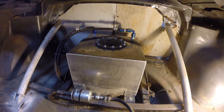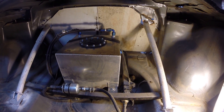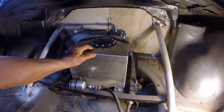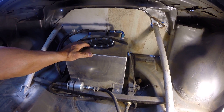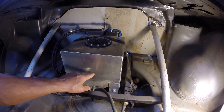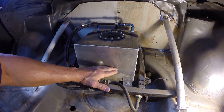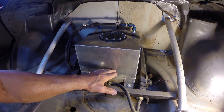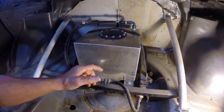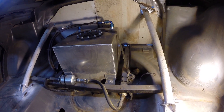Welcome to the garage. Today I'm going to show you the race car fuel system, starting with the fuel cell. I got a nice anodized one from Summit for an old car — I actually sold that and picked up this lower-cost non-anodized one. This fuel cell has foam about halfway filled inside to keep the fuel from sloshing, while the anodized one was about two-thirds filled with foam — something to keep in mind.